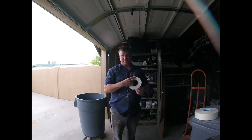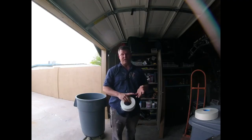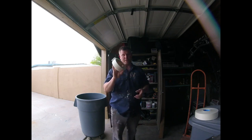And then we repeat that process and do the same thing again, and then we can turn around and get it second coated and even do a third coat and texture it all in the same day, one trip job. We do a lot of repair work, so we do one trip, in and out, in and out. So we use a lot of fiberglass tapes for patchwork, repairs, and stuff that we want to get done in one day or one trip.